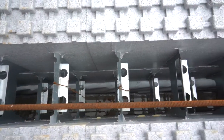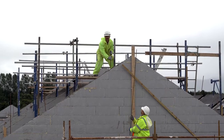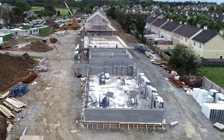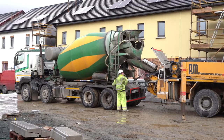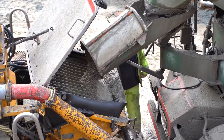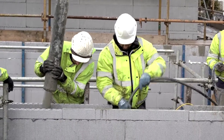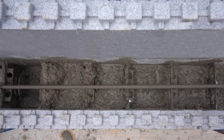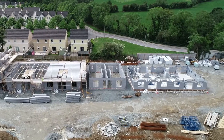A grid of horizontal and vertical steel rebar is placed into the wall cavity to enhance the strength of the structure. Walls need to be aligned using our propping system to ensure they're plumb and straight. Once erected, the wall cavity is filled with concrete and then vibrated to ensure sufficient compaction. Walls are poured a storey height at a time, delivering a solid and strong structure, as well as excellent acoustic and thermal performance.